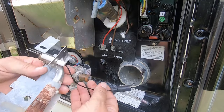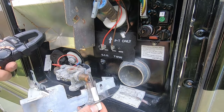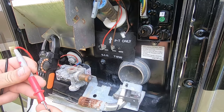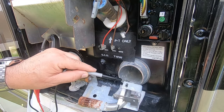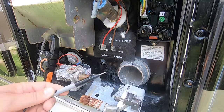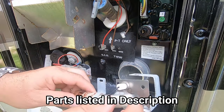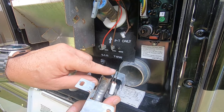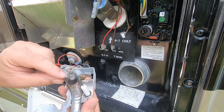I'm going to check this for continuity because it is definitely cracked. Although this was sparking fine, it does show a crack. That has good continuity, but being that it's starting to crack, I will probably order a new one to replace it. This whole piece comes with it — this is the sparker, and this is a grounding rod. When a flame comes, the spark reads that there's a flame and sends a little current back through this item. Very important. So I probably will order a new one since this is starting to crack, and I'm going to adjust this after I clean the tube.